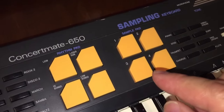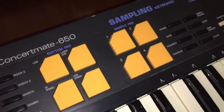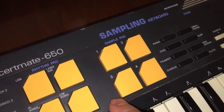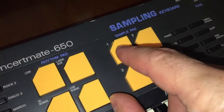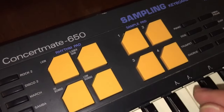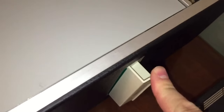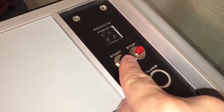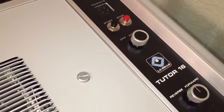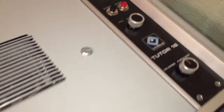The first tone that advances the slides, and I call them slides, but they're actually 16 millimeter film. Just think of it as a PowerPoint slide off 16 millimeter film. The first sound is this sound, so that advances the slide. The second tone is this one, and that one tells the machine to stop and wait for you to start it up again. So for the tape to start, you actually have to hit the start button here, which hits a relay and causes the tape to start moving. And then when it stops and pauses, you have to go up and hit the start button again.